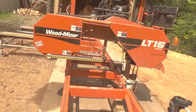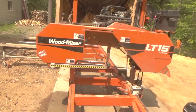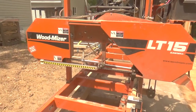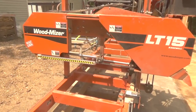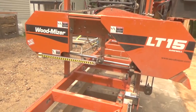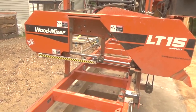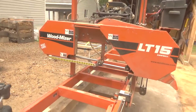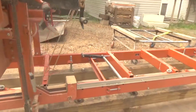The other thing that was a little bit of a nuisance was — if you've never used a sawmill before and you're not used to the sounds it makes when the blade hits something — that was my biggest problem this past year. The blade hit a nail in an oak log, and all of a sudden the blade was dipping and diving. I changed the blade, and then without even knowing it, I hit another nail in the same tree. The problem was not the machine and not the blades — the problem was that I was hitting stuff and couldn't tell what I was hitting.